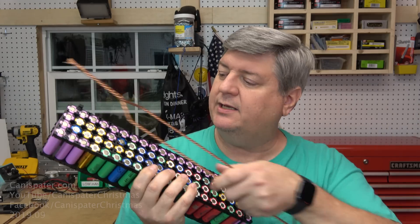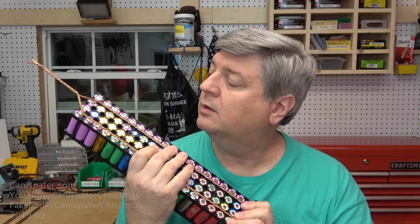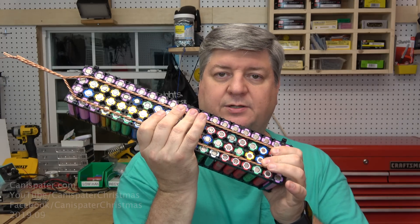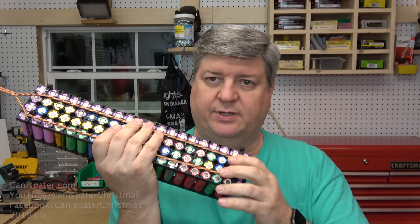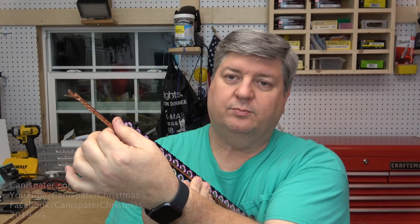As it turns out, it's actually very important to the overall system because it carries energy into and out of the cells. As an example, you need a way to get the energy out of each one of these cells. So people have put bus bars in there like this — can you see it? You bring it down here to a single point, and then they put a lug on that. And that's how you get energy out of that side. You have another one on this side that does the same thing.